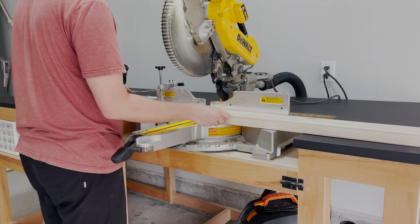Now I move on to creating the border of the workbench. I line the 21-inch long boards in the middle, and the 48-inch boards are on the outside of the 21-inch long boards. I'm going to put in two screws on each location, through the 48-inch long board into the 21-inch long boards, going around and making all these connections.